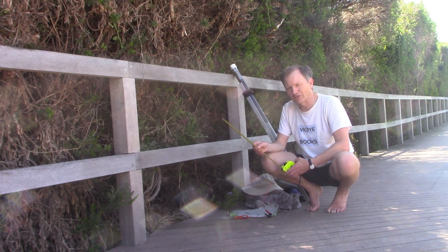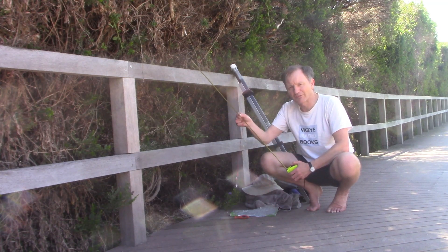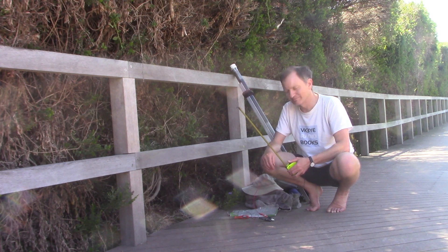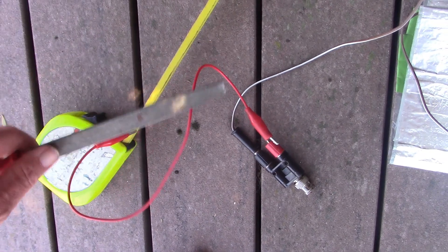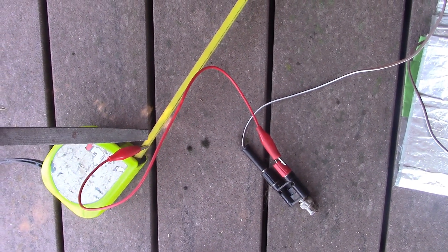Today I'll demonstrate another. I'm just using a metal tape measure that can extend and I will vary its length according to the band I need to cover. Here's a closer look. This is the radiating element and with a file I've just filed away a bit where I need it to make contact.